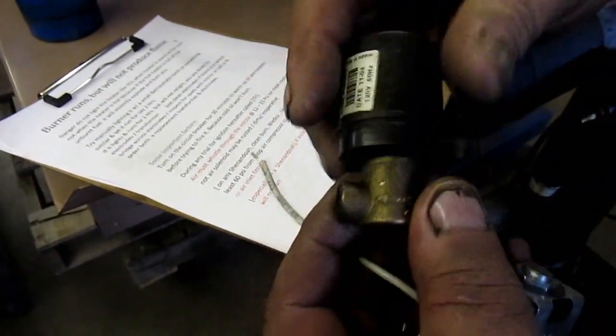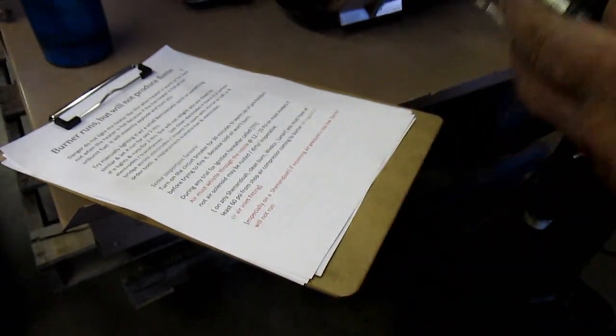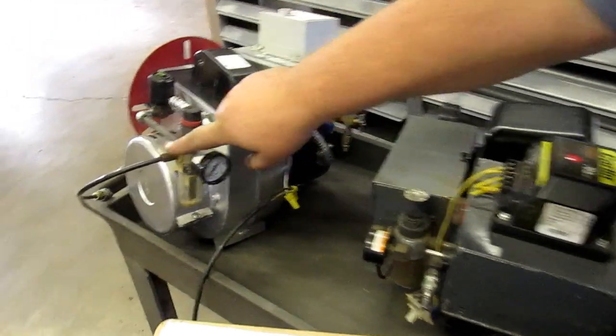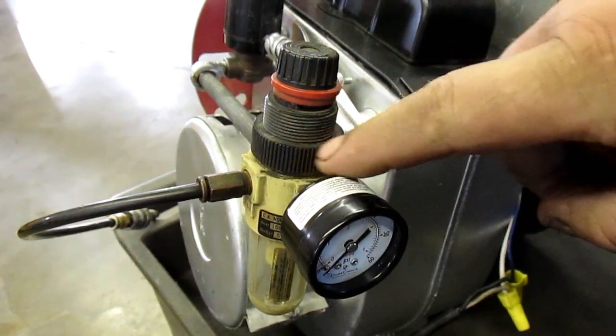There are different styles of air solenoids. Inside is a metal plunger with a spring — the electromagnet opens it and the air comes through the burner. On any Shenandoah, Cleanburn, Wedco, or Lenair, you must have at least 60 PSI from the shop air compressor coming to the burner air regulator or the air inlet fitting.